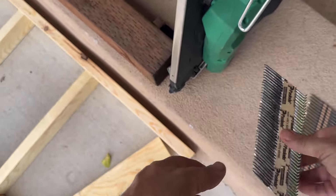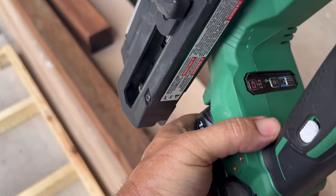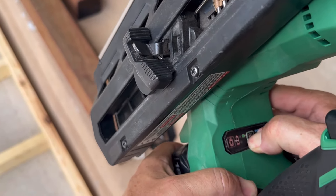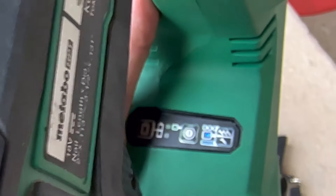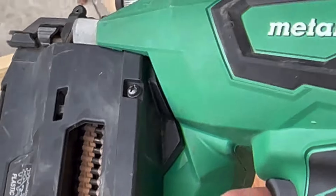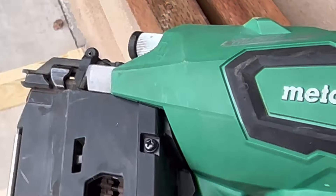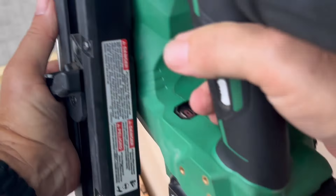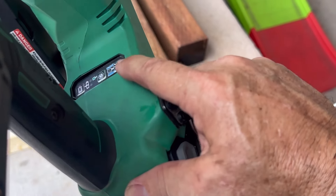Let me go through the Metabo. A couple of things you really like about it: it's got a nice ergonomic grip. When you turn this on, you can see that green light that comes on there, and on this side there's a little blue light. The blue light is telling you what mode it's in. If I push that button and it's flashing, it's going to shoot in bump mode — once you have the trigger depressed, you just bam, bam, bam, slap your point on the lumber and it fires a nail. So it has two different settings: one is the traditional way, press it up against the lumber and pull the trigger; two is keep the trigger pulled and every time you push against the wood it fires a nail — a rapid fire mode.